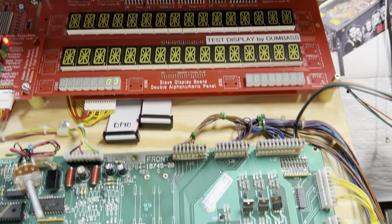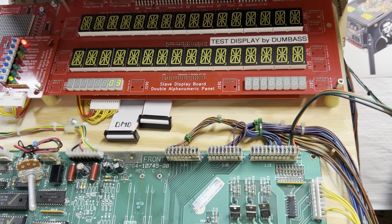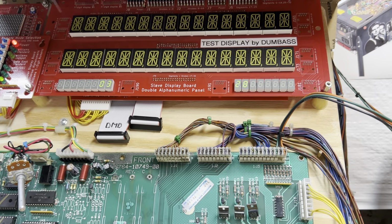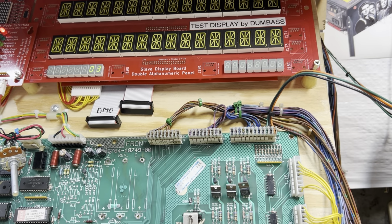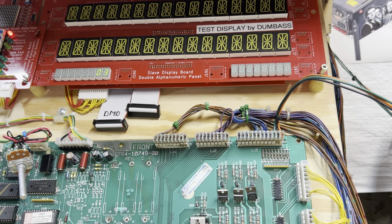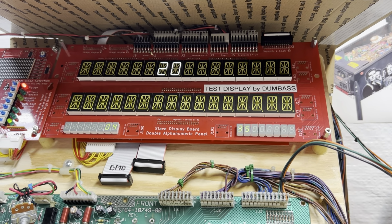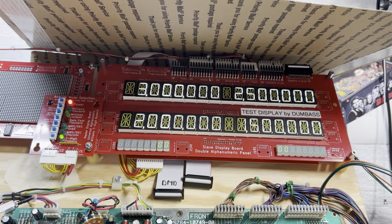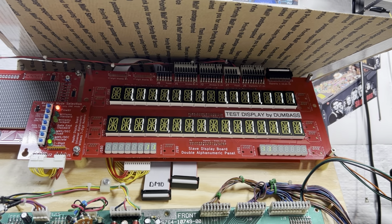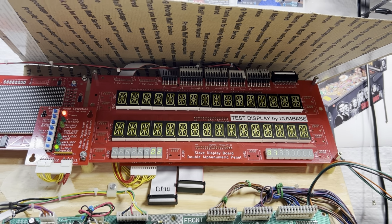Sorry. It's been a while since I did a System 9 switch test, so I'm going to close these switches across the diagonal until I get to 46. And then the last switch is switch 50 for Comet, so there we go. And I have already set this to free play. Let's go through here and find out what's going on with that solenoid. See if we can do some quick testing. Let's get it into solenoid test.